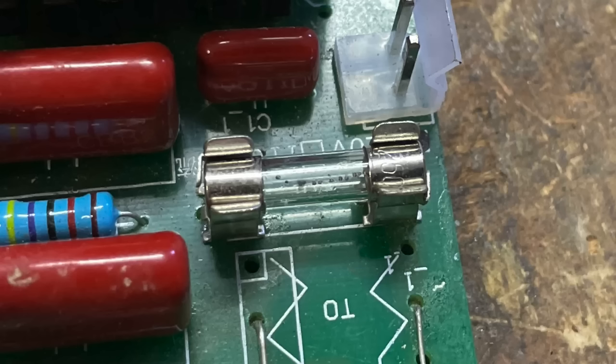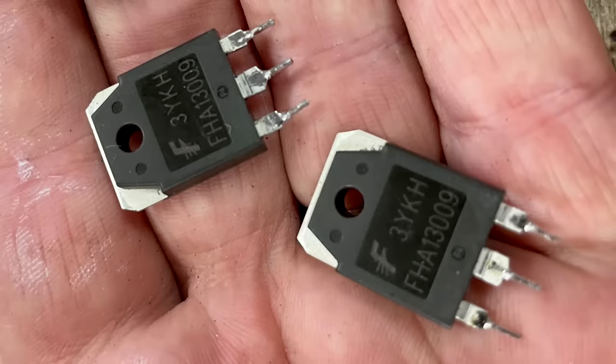After a few cleans, I heard a pop and realised that one of the drivers had blown a fuse. I replaced the fuse, but it immediately blew again. So I removed that driver — which meant I was now down to only 300 watts of power, but it was still cleaning okay. I inspected the driver and it appeared that two voltage regulators had blown. Maybe they were affected by the heat, the transducer falling off, or maybe they were just faulty or low quality — who knows.